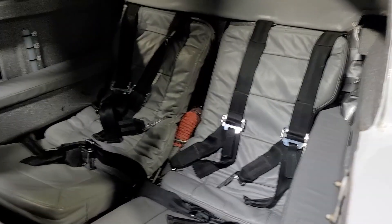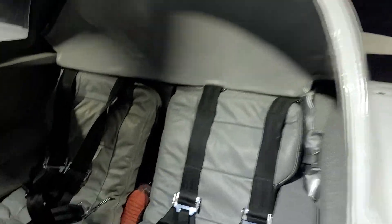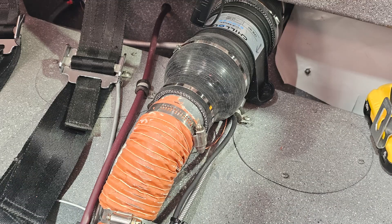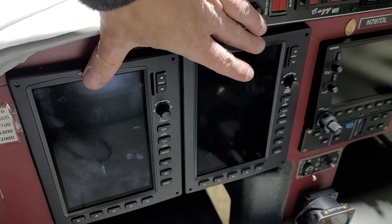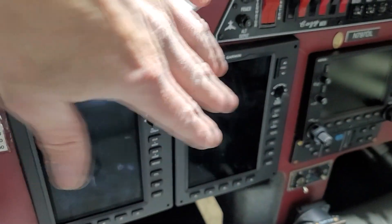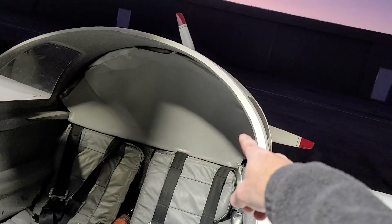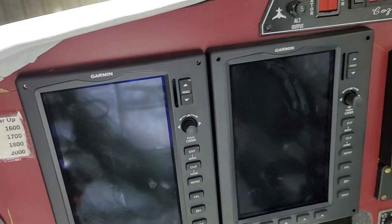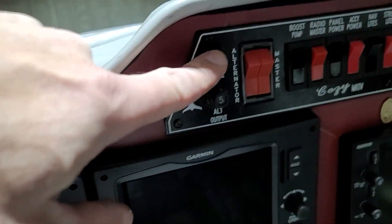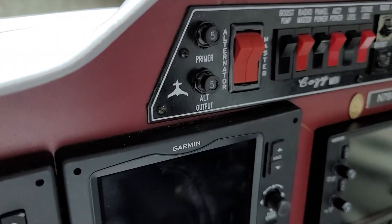It's taken all day — it's dusk now and I've been here since 10 o'clock this morning. But I have my new heater fan installed. I can turn it on down here — there's my heating fan control. I also have my EFIS button here that I can turn on to energize my Garmin G3X and the engine control panel. I can actually turn on the EFIS and see my oil pressure before I start the engine, which is fantastic. And I have two new circuit breakers: the top one is the charger for the EFIS backup battery, and the second one is for the heater fan. Those are two things that have been on my list for a while and I'm pretty happy they're now installed.